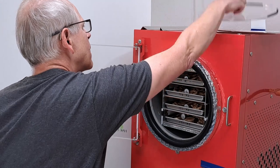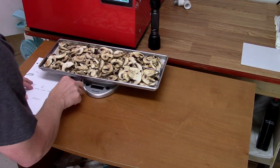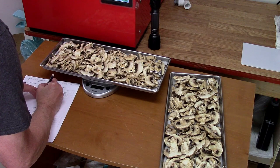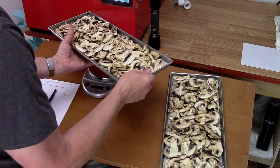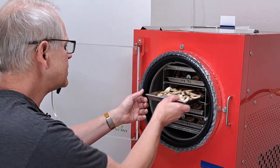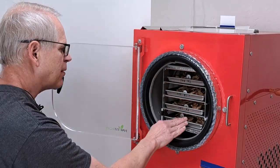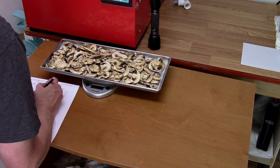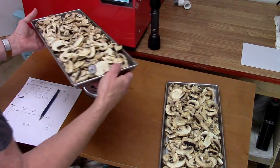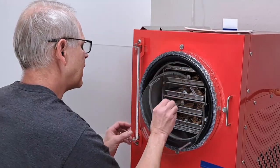We'll open the drain valve. Tray one — very light now — 808 grams. Tray two — 802. Now we're going to switch the location of these two: putting tray two up on top and tray one down. These center two spots tend to be slightly warmer than the outside two, with the bottom one usually the lowest. Tray three — 797. Tray four — 803. We'll put them back up, put tray four up one, tray three down one, and get that resealed.